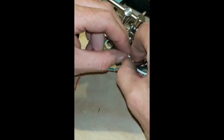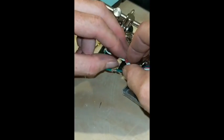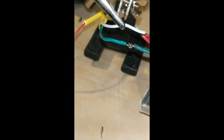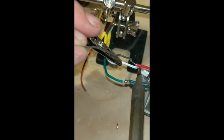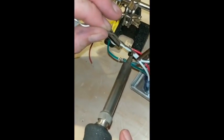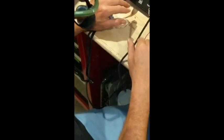Once you get it lined up, you can just drag the iron across like that. Look at that — that's what you're looking for. You don't want the wires to be half-done. Make sure the connection is solid before moving on to the heat shrink step.